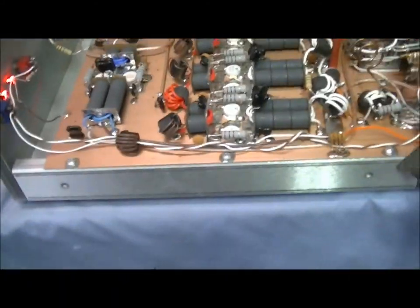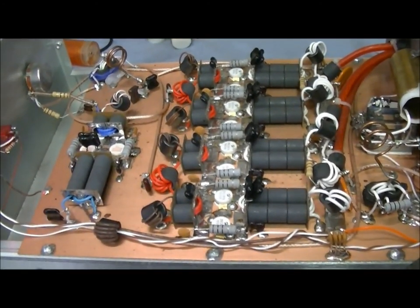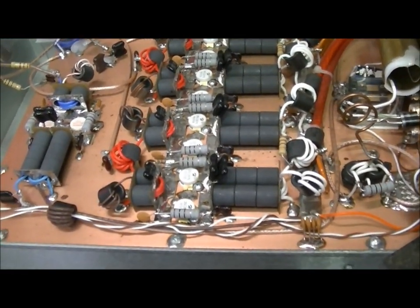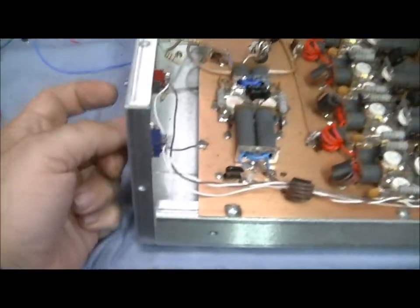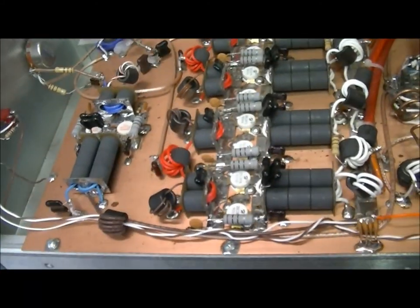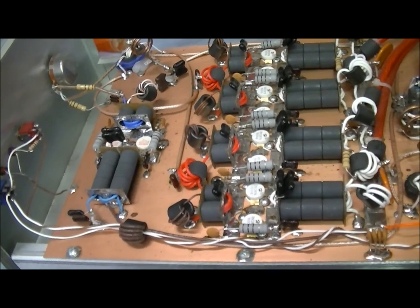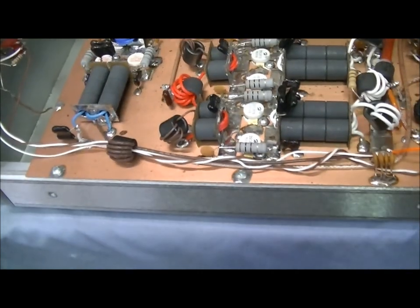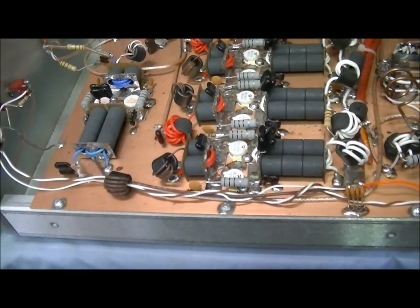And one thing you will notice when you're dealing with staged amplifiers like this, you do get a little bit less out just from the loss of having to travel up and down all these mini coaxes. For example, if I hooked up an external driver and turned this 2-pill section off and turned the 8-pill section on, I've noticed you'll normally get maybe about 100 more birds. So it probably would have been doing about 900 bird there. But that's not a noticeable difference on the other end. So we're getting about 1500 peak, a little bit under 800 bird. So she's ready to rock and roll, man.